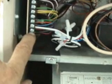This only takes 24 volts of power, so all I need to do is connect my common and the 24-volt side of the transformer to these wires, following the instructions. I attached the white wire to my common side of the transformer and the black wire to the 24-volt side. Take a look at this A-coil and you'll see where I mounted the ultraviolet light, and towards the bottom you'll see a viewer where you can see that the ultraviolet light is working.